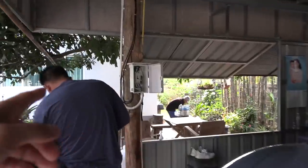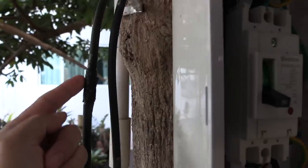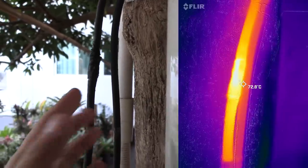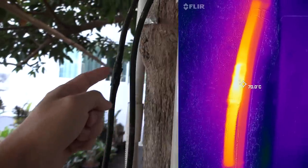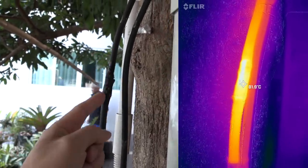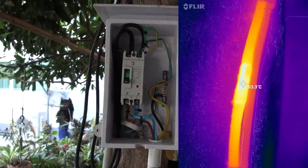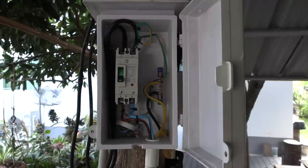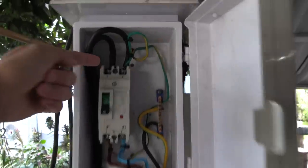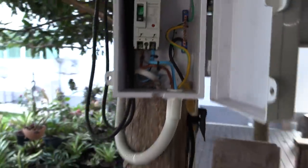Right now, what we're going to address is this cable here, which has been joined. This joint became really hot when I charged at only 16 amps — I measured with a thermal camera and it reached 85 degrees Celsius, only at this spot, not the rest of the cable. The installation here was messy and something was not done correctly at the joint.